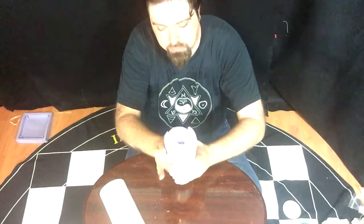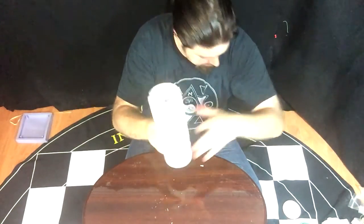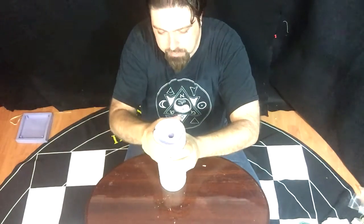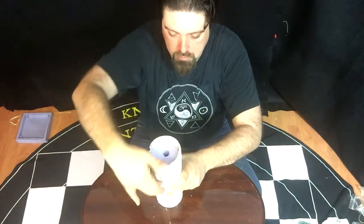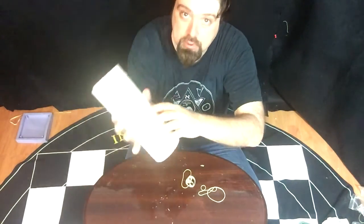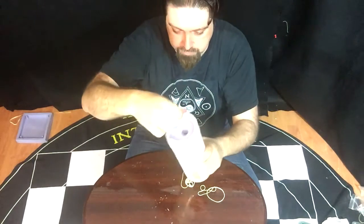Basically, you have to keep these two pieces like this, because this is just an empty thing at the bottom — if you pour hot wax through here, that's going to make a big mess. So what I do is I take this little guy, which is a plug for a PVC pipe, and I stick that on there. Because of the nature of things, this is all not going to stay together all that well, so then you just take a bunch of rubber bands and wrap it around it and it holds it all together. You're going to get a little bit of wax pouring through — you'd see that there's a little bit of wax on it, because wax kind of drips out a little bit. If it pours out a lot, you probably need to reorient the whole thing.